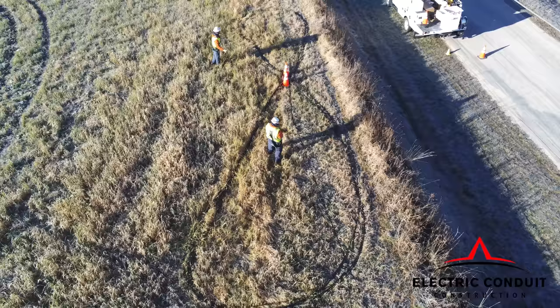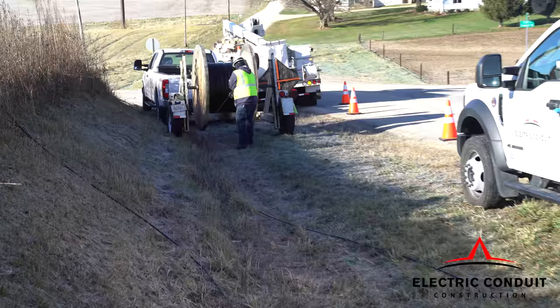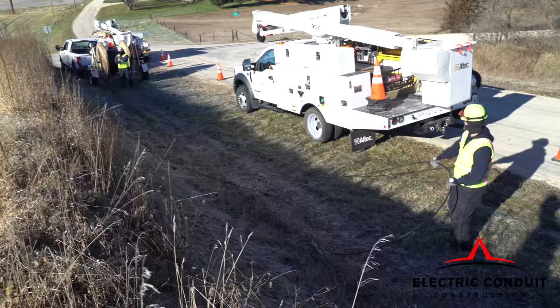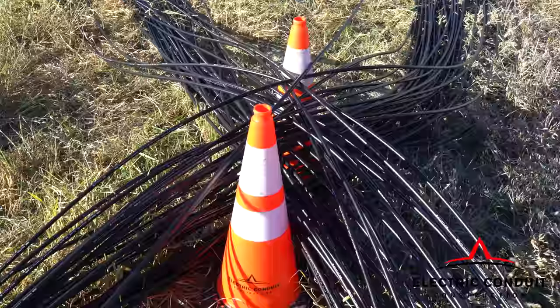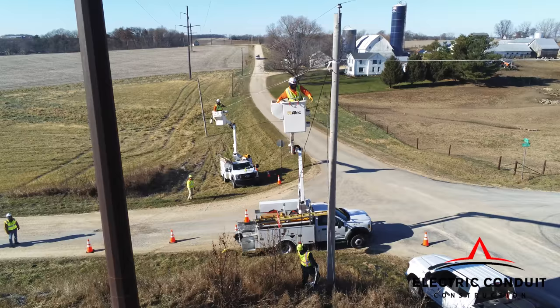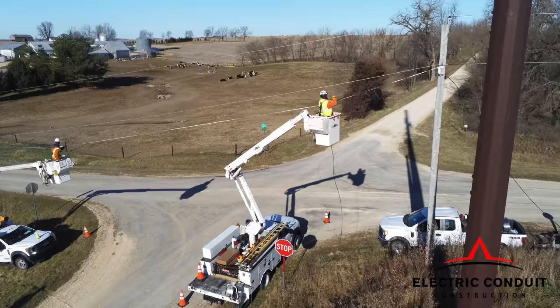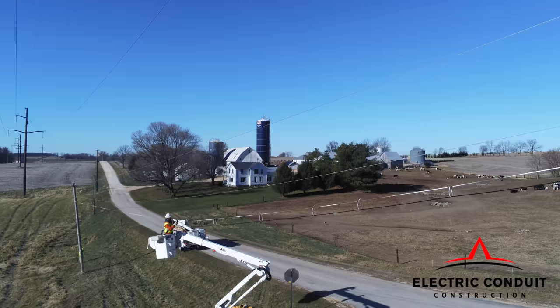Fiber install will continue down the aerial route, but we first need to get the other end so that we can continue. That is the reason for the figure eight pile. ADSS fiber can be installed quickly after the poles are framed and the hardware attached. The final step is tensioning the fiber to create the proper sag between each pole. When this is done, the clamps on each pole are tightened and the fiber is installed and ready for service.